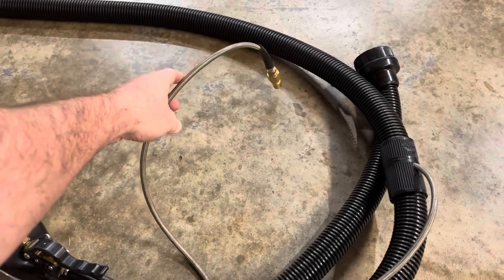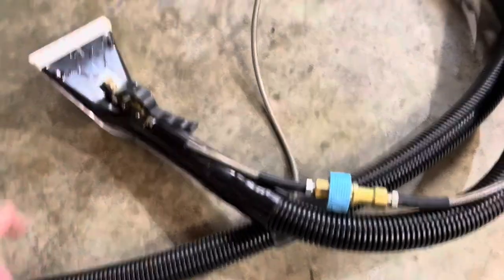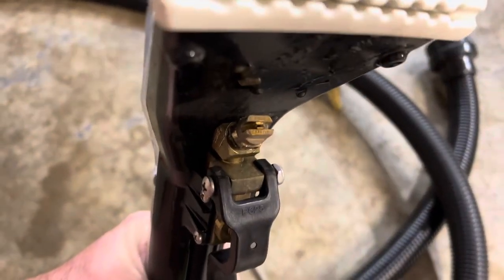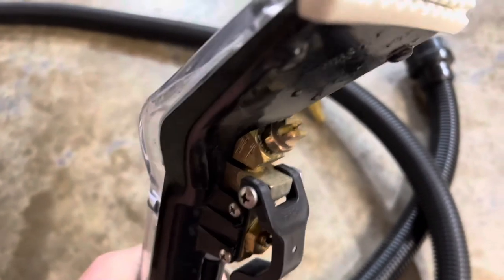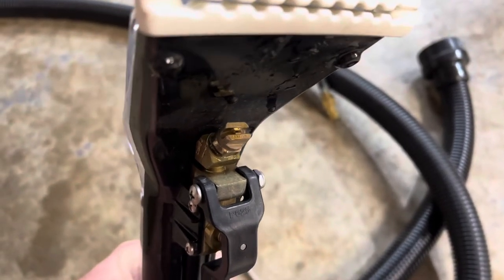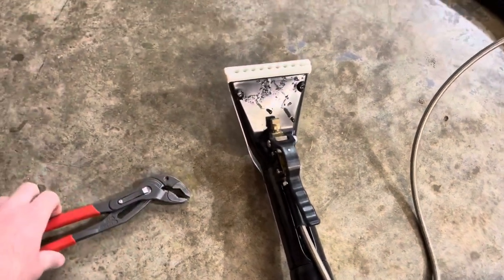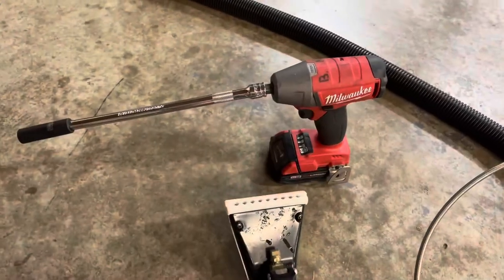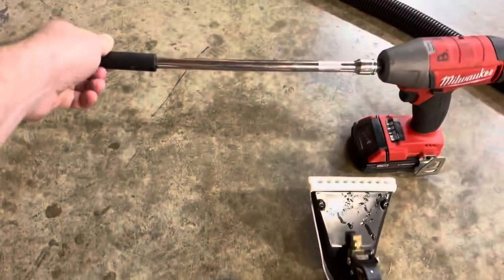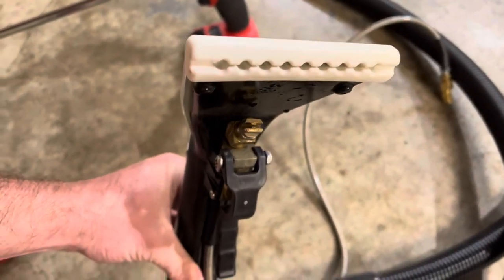I started thinking it was probably a fitting that was clogged up. I took this apart and didn't see any debris, but the last thing — I know this from pressure washing because I mess with tips a lot — these tips right here can get clogged up pretty easy. I ended up taking it off; it was on there pretty good, I couldn't get it off with channel locks or anything. So I held this bar with channel locks so I wouldn't crack the plastic, then used my impact with a half-inch socket and an extension to get it off.